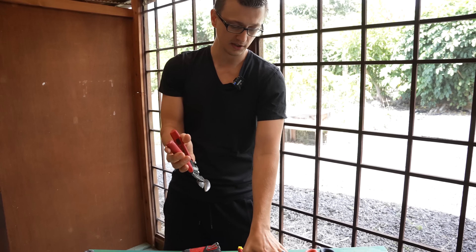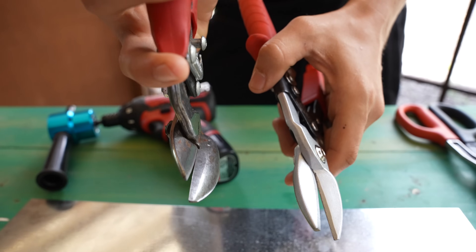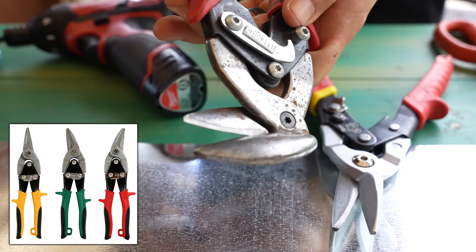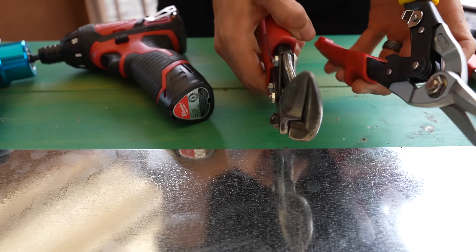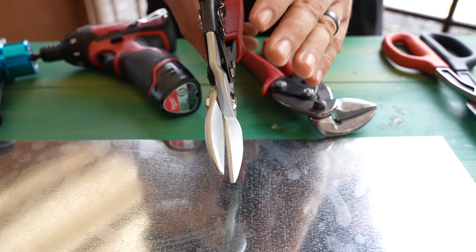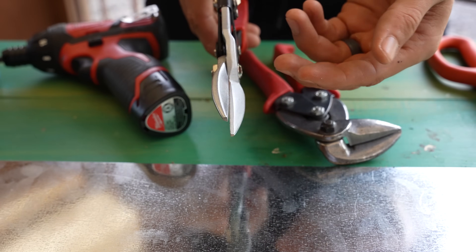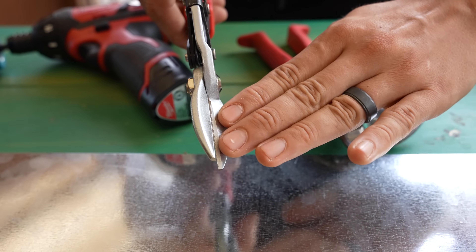The offset jaws are usually bigger. If you look at this jaw compared to this jaw, see how the offset jaw is a lot bigger? And when I'm cutting, I can angle these this way so I can totally see what I'm cutting, and all the sheet metal is coming out this way. They're called left-handed and right-handed snips, but actually they're all meant for the right hand. The only difference between the different colored snips is that the jaw is positioned differently. On all the red-handled snips, the left jaw is going to be on the bottom, but on the green one the left jaw is on the top. And wherever that jaw is, that's where the sheet metal goes.